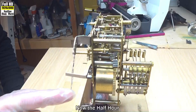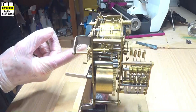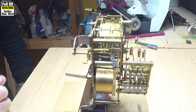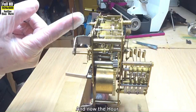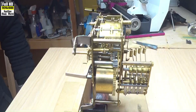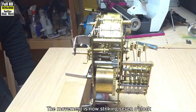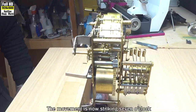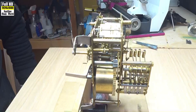The pendulum seems to be working all right at the moment. We'll advance the wheel to three quarters. Striking one, two, three, four, five, six, seven. That doesn't seem to be too bad. I'll make an adjustment on the pallets, because I think that is probably what the problem is. I'll make an adjustment on that and we'll check it out again.